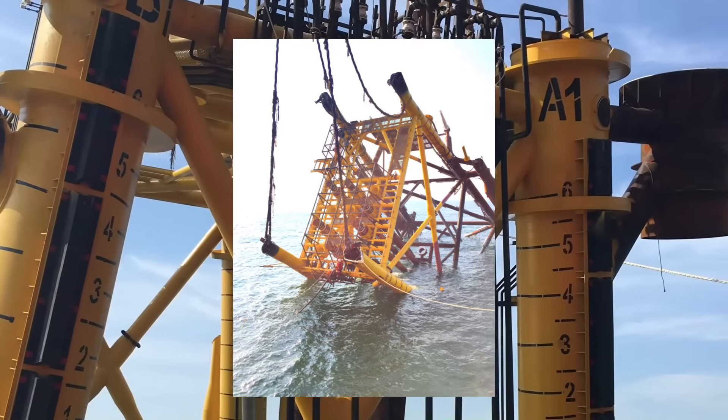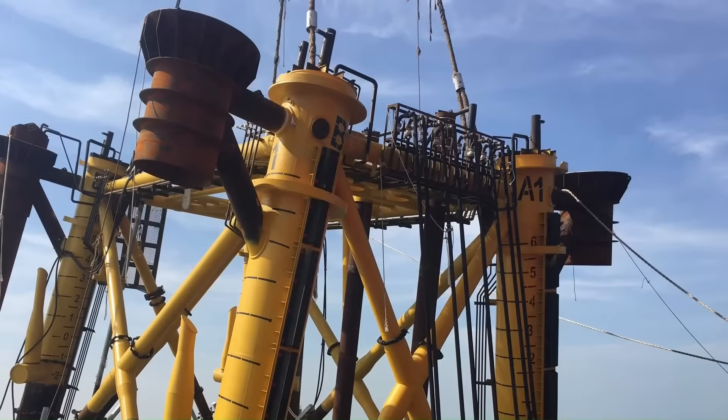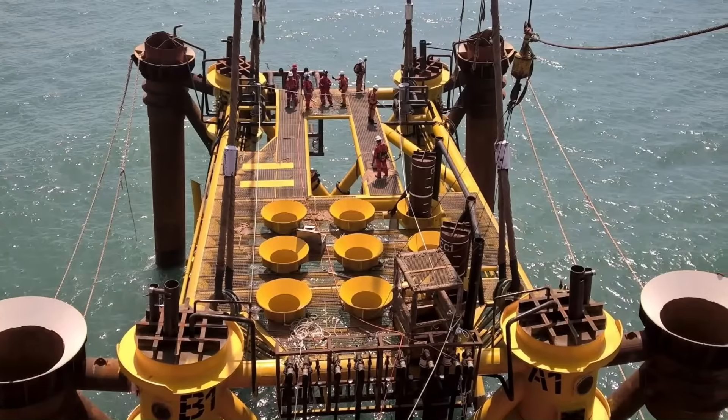Once the jacket is upended, it's straight up and down and about half a meter from the seabed. Specific positioning and heading equipment has to be installed on top of the jacket. This will be done by the surveyors, and I will come back to it later in the video. With the help of the positioning and heading equipment, the jacket — the bottom half of the total platform — will be installed on the seabed.